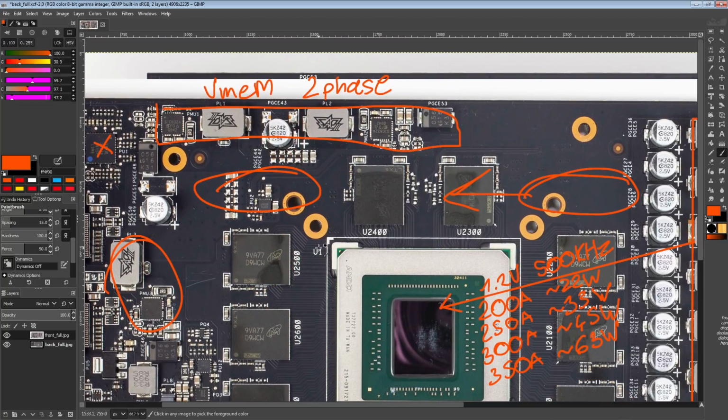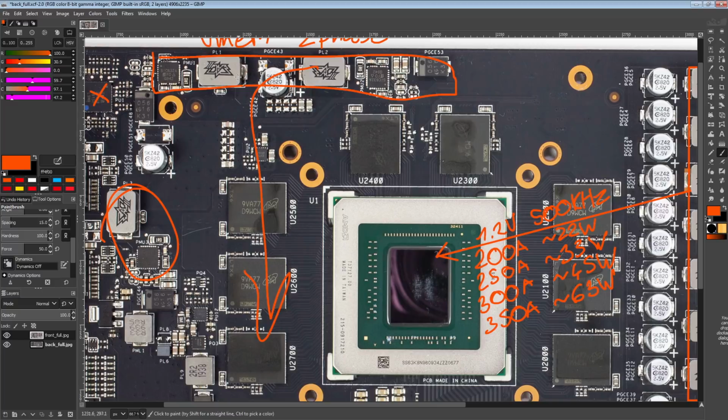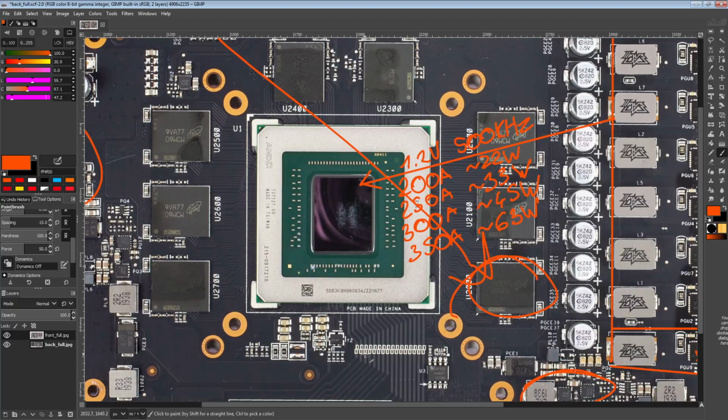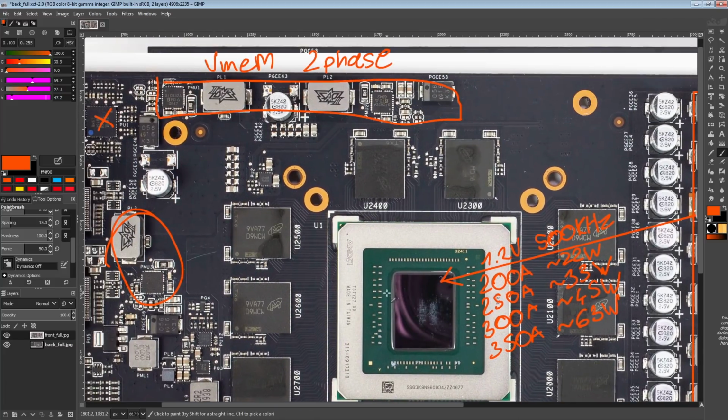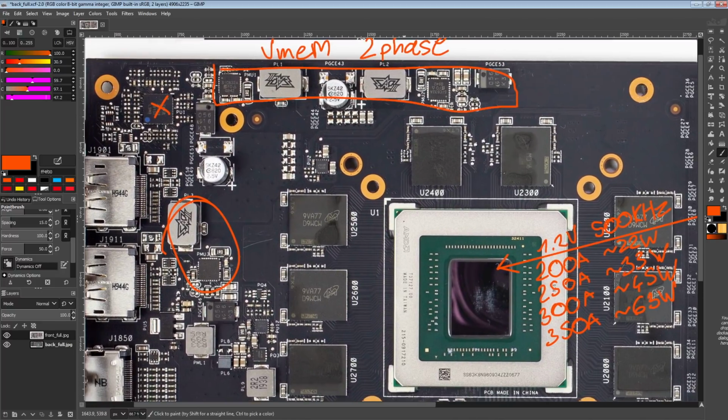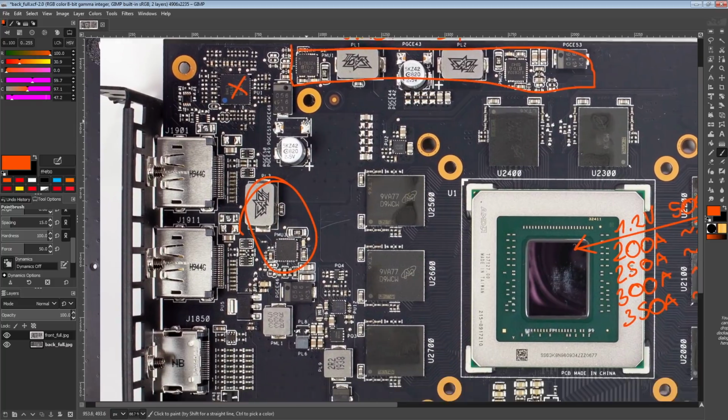And so, yeah, I'm not really a fan of the fact that ASUS basically went and sort of screwed up the power distribution, right? All of it now comes from over here, and so now you do have a far away chip, it's that one. So, yeah, not really a fan of this redesign, but there's more 5700 XTs that do this. If I had to guess, this probably doesn't make that much of a difference, but you could lose a couple megahertz worth of GDDR6 clock depending on how exactly this is implemented. It could also be that they're compensating for the rearranged VRM in some way that I can't see, but generally you want your power delivery as close to the thing you're trying to power as possible. So, yeah, not really a fan of the fact that they moved it up here.